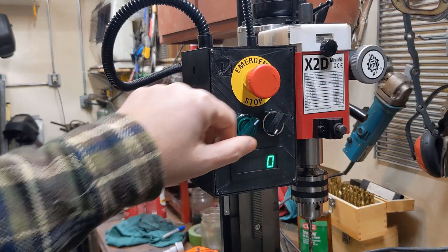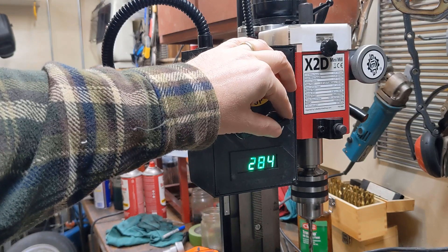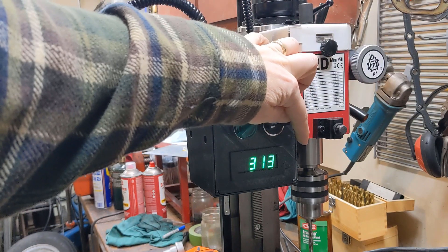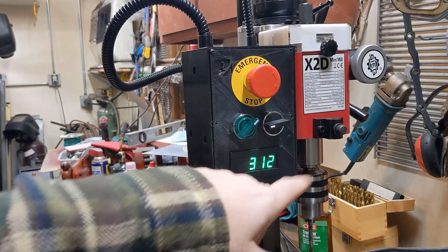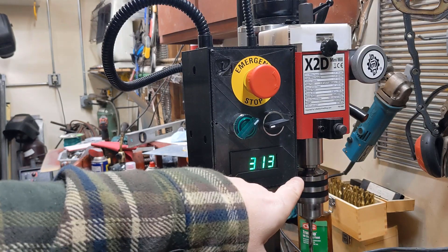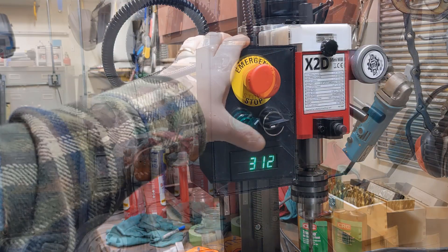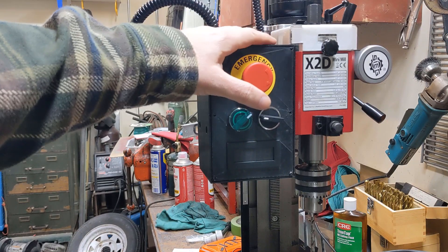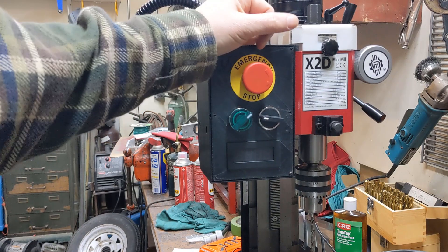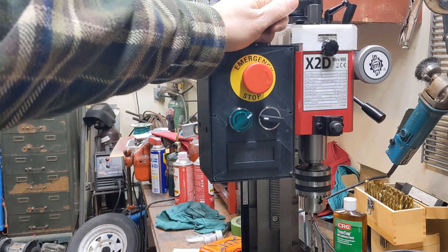I found another magnet - actually found a package of them. I haven't glued it on yet, but you can see that magnet has a polarity that has to match. When you put it on, make sure you test it first, because if it reads zero - which basically is a negative number and this can't display a negative number, it just reads zero - you have to flip the magnet over. So all in all, if you've got one of these Sieg mills, this is actually a really good upgrade. It's a much, much better motor drive, and it will allow me to upgrade the motor in the future. That's all there is to it - thanks for watching.